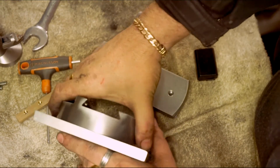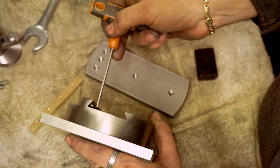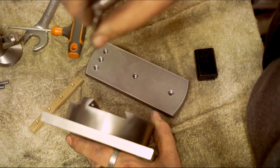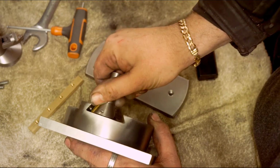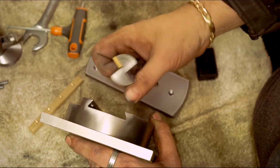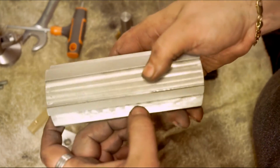Like that, because what you can do is think in advance and just mill this centre section down a little bit more, or end your dovetail a little bit higher. So the bottom edge of this cutter isn't rubbing as it's turning, it's rubbing that surface all the time that you've just cut, and you're going a little bit further, and it's rubbing again, and again. Now if that was lower, that wouldn't be an issue, that's easy to do, but with this side it's a lot harder. I've got to clean that up still.